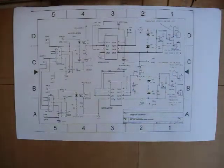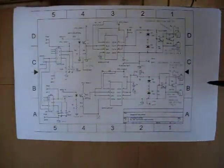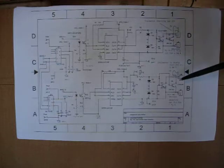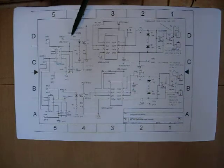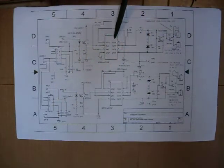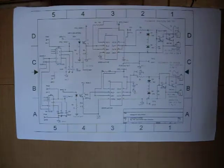I'm going to go through the schematics with you. This page here, this area here, dumps out the positive battery or positive caps into the motor coils. This does the negative side, and what comes in here is through an opto-isolator, and these power supplies are also isolated. This input here comes from the LED sensors on both the positive to dump and the negative to dump.